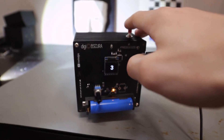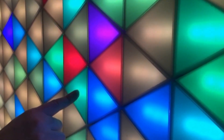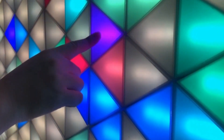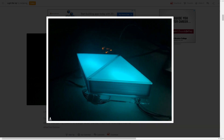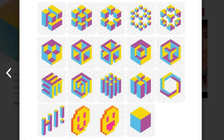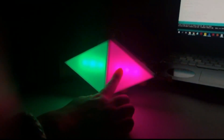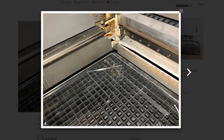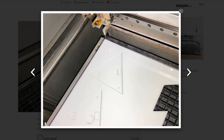Sean includes all the resources you need to recreate it on his Instructable. I also love this interactive light board project by Hai Wan Shin, Yu Jung Ko, and Jun Sung Yi. Using laser cut triangles of diffused acrylic and 3D printed cavities behind them that hold the neopixels and tactile switches, the team created an infinitely expandable light board. By pressing on a triangle, you can cycle through different colors until you release it. The images you create have a cool voxel 3D look to them. There's no small amount of work that goes into making something like this — I have to imagine that each triangle takes at least a few hours of printing, cutting, gluing, soldering, and connecting. Fortunately, the documentation on this project is outstanding, so if you do take it on, at least you won't get lost.